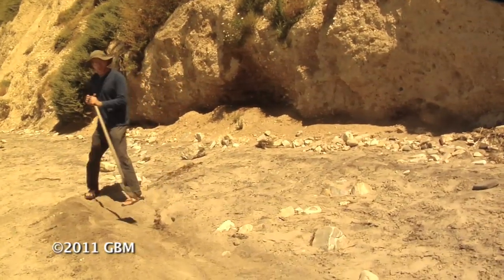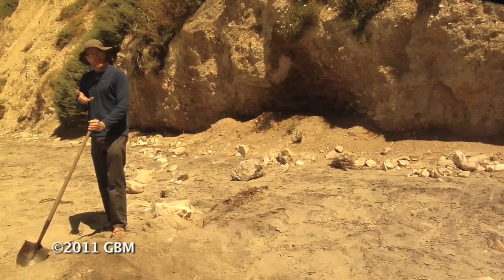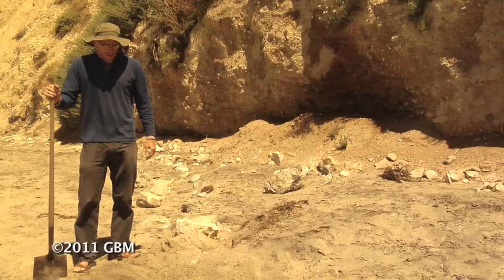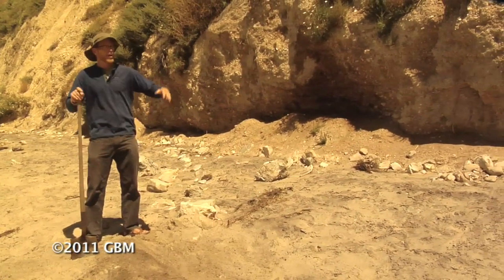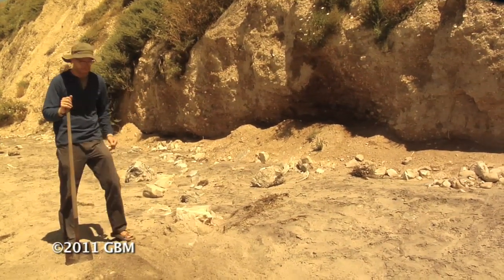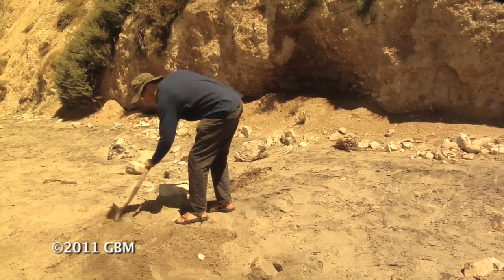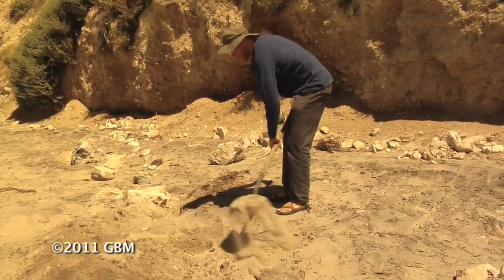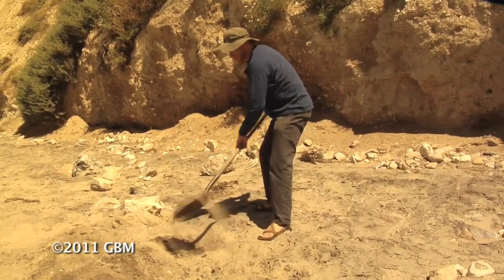This works great but notice that we just stopped it on our line. We can continue this contour swale or contour berm engagement all along the contour for a good distance - we're just going to stop here for now. The key thing is we want to make sure we kick this part of the berm upslope on both sides, so if we get a rain it doesn't just collect behind here and then run out. If I need a little extra dirt, I make sure I take that from upslope of the structure, making a basin upslope and increasing the capacity of the structure at the same time.